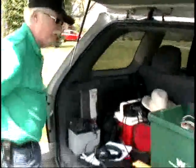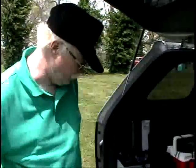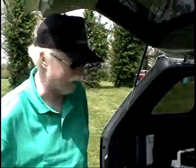I looked online and found out how to wind them. I wound a couple, and basically they all look the same. I did make one that will work 40 through 6 meters with the tuner. Then I made one that's just a monoband 20-meter one. You don't need a tuner with it. It's pretty much below 2 to 1 on the whole band. All right, well, that's Bobby, KB-QRP. We're going to go over here and see some other folks.